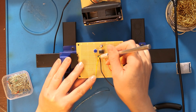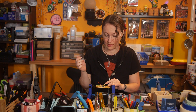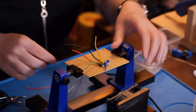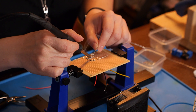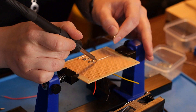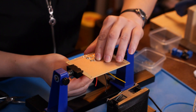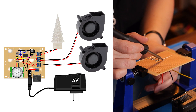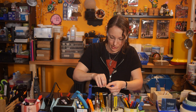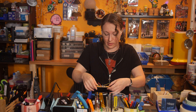Pin 8, the potentiometer, and the 10K resistor that goes to the trigger are all going to get soldered together because they all need to connect to VCC. I'll also add a red wire that I can use to connect that later. This TAC switch will let me manually trigger the timer, so I can use that for testing and setting up the timer duration without having to mess with the PIR sensor just yet.